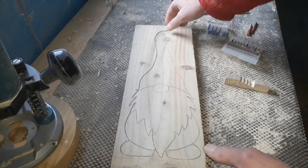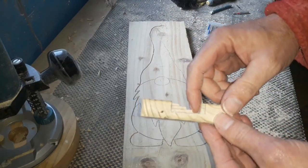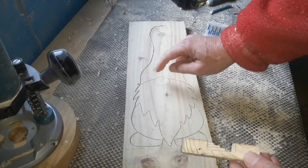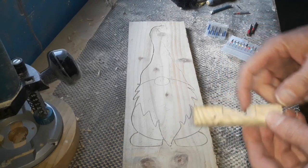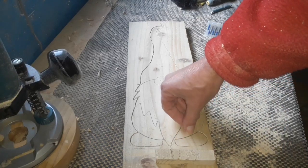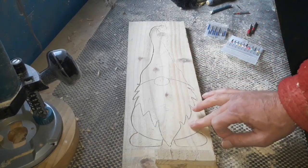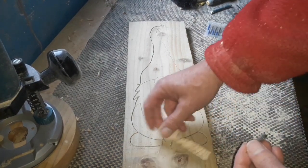Okay, let's start off with the deepest area, remember, which is number 5 down here. 1, 2, 3, sorry, 1, 2, 3, 4, 5. So level 5 down there. I'm going to use CNC bits just for the lines to get me going around here and around here. What you've got to remember is these are all different depths. So number 5 will be the deepest.